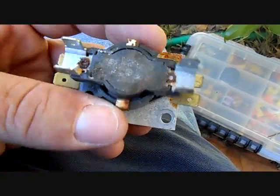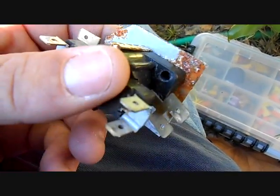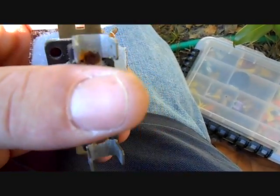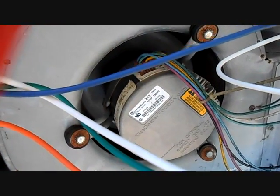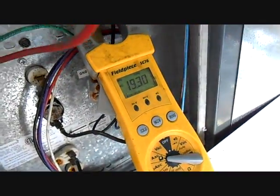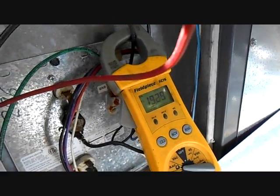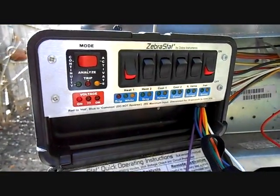We have our panel back together — it's a bit rough, looks like it got some rust on it from water condensing on that panel. It might have aided the sequencer's destruction. We have the fan and heat on; as you can see the fan is running just fine, so my first guess was wrong. And we do have 19 amps now flowing through the heater, which means the heat strips are on — which is the reason why this thing wasn't heating enough.